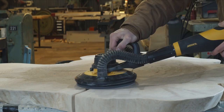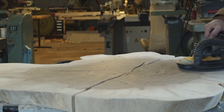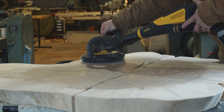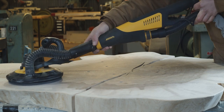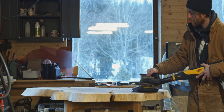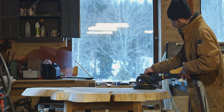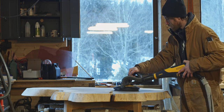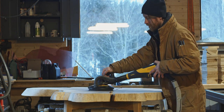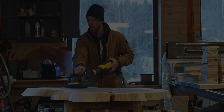For the final sanding I use this Mirka sander, which I think is meant for sanding drywall. It does a horrible job of actual wood removal, but since we already have a pretty nice 120 grit finish on here, I can use it. It has a large 225mm diameter pad and taking it up to a 180 grit finish goes pretty quick. The strength of this machine is that it leaves an absolutely flawless finish — the sheen it creates is incredibly uniform, and having a uniform sheen on large surfaces is one of the most difficult things to achieve with small sanders.